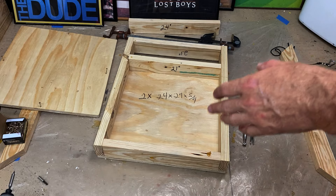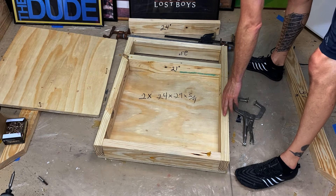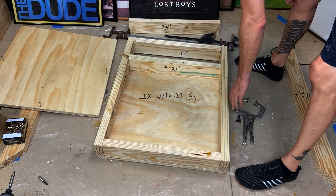At this point I've taken the two 30-inch runners - the long length ones - and attached them to all the 21-inch boards. So this is your front board, the back board, your wall plate, and your runners. I will tell you, I forgot to mention this earlier - if you do happen to have some wood clamps of any type or vice grips, it does make putting these things together a little easier. But we're going to wind up with a very solid platform.